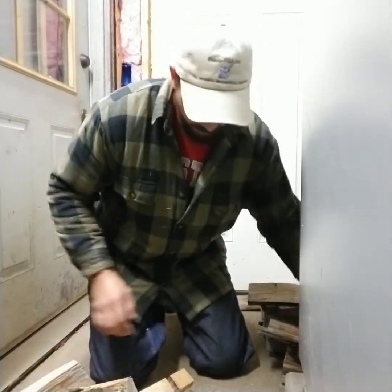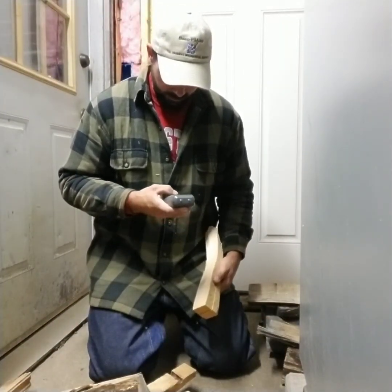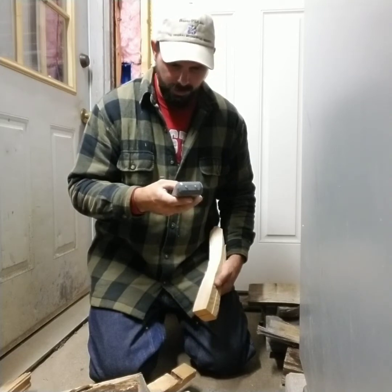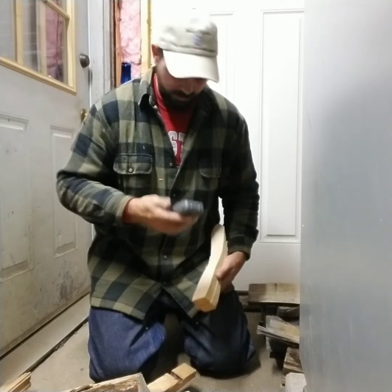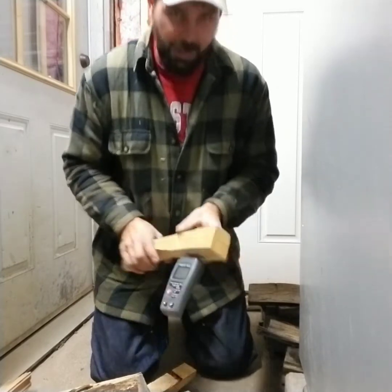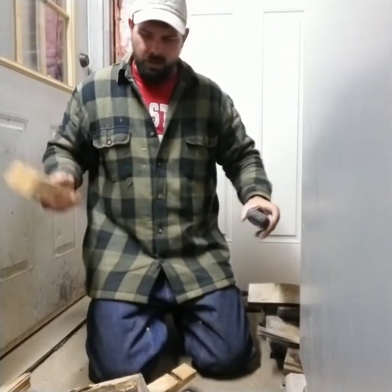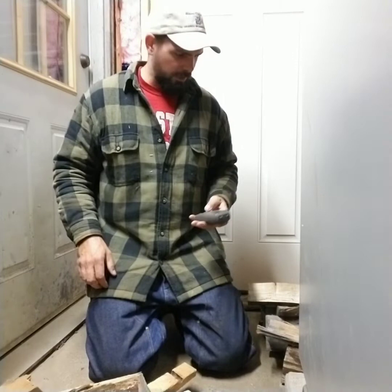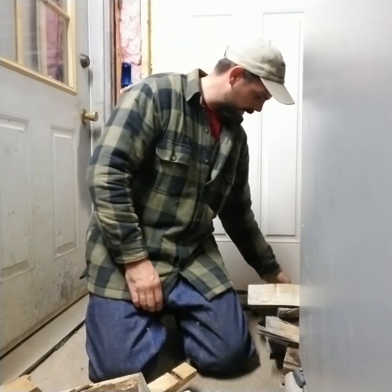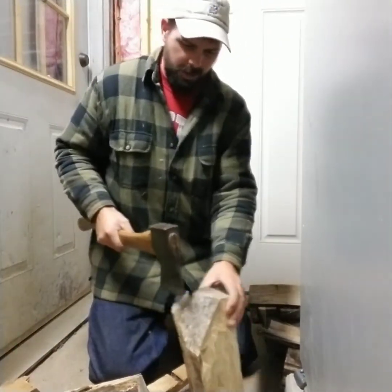Here I just split a piece of rough cut 2x4 — let's see what that says. I don't know when the last time I changed the battery in this is, but sometimes it does funny things if the battery's dead. Here's a piece of pine, rough cut, not kiln dried or anything — it's 14%. So I have a hard time believing that maple is 45%. We've been getting rain the past few days, but I don't think it's a sponge at 50% or 45%.